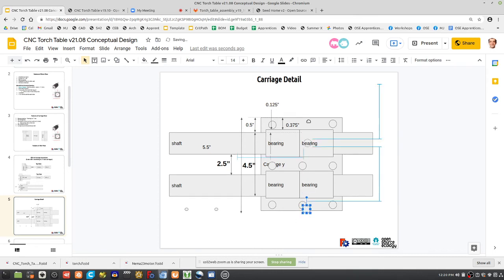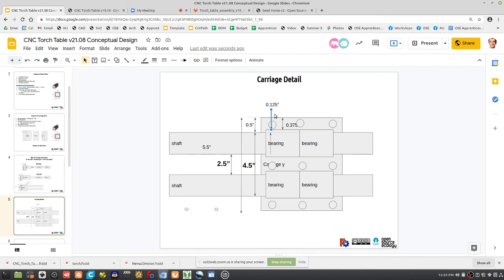And what I would do here, make all of these things 5.5 millimeters, so when we need to, we can either use them for threading or drill them out a little bit to have the pinch effect happen. So drill them out to like 6 or 7 millimeters, so that the bolt goes right through one piece, and then in the second piece, you're actually threading in. So make all these 5.5 millimeter.